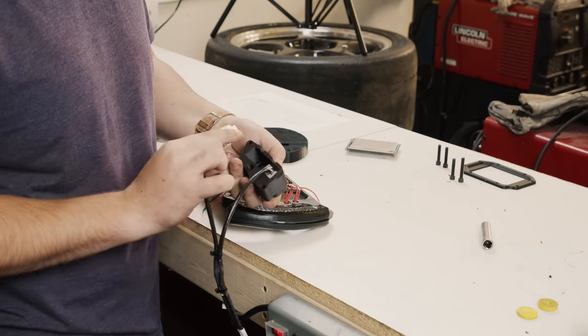Moving away from hand-drawing literally all the graphics might be kind of necessary. We also have a Wire library, so all of the data moving from the main ECU on the car to the steering wheel is done through an I2C protocol — a really cool protocol built in the 80s by IBM, I believe. That limits us in two ways: it's really nice because we only need two pins in and out, digital 2 and digital 3. But it also means we couldn't run from one end of the car to the other — even with Cat6, really a meter is about the maximum.